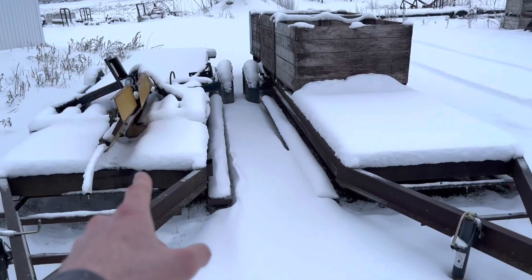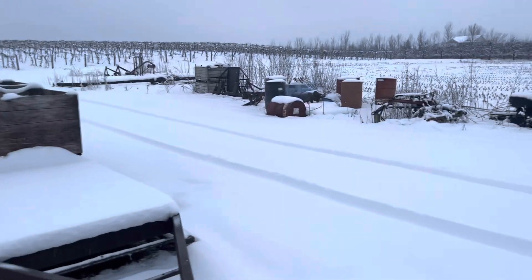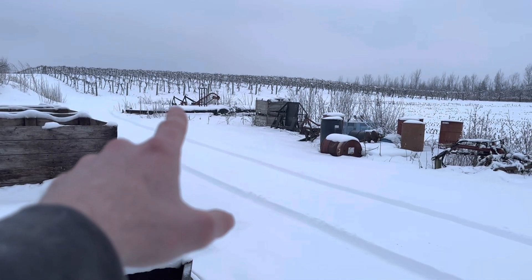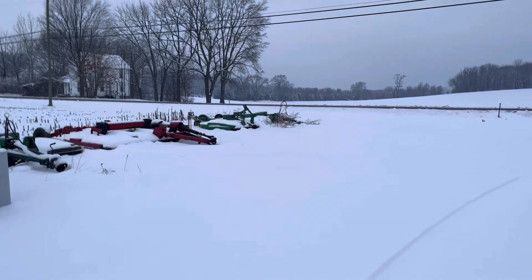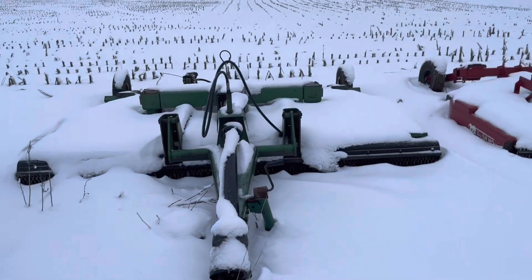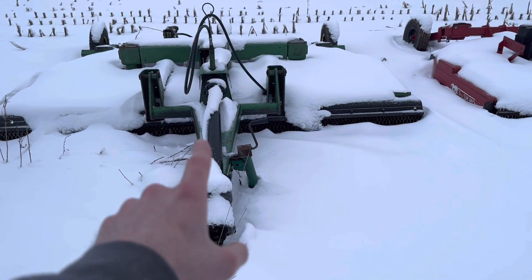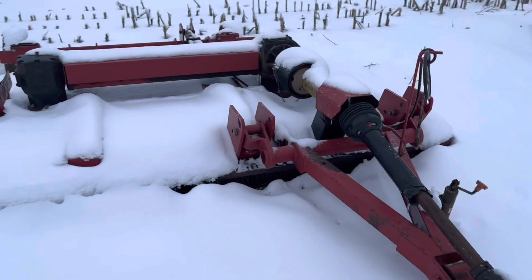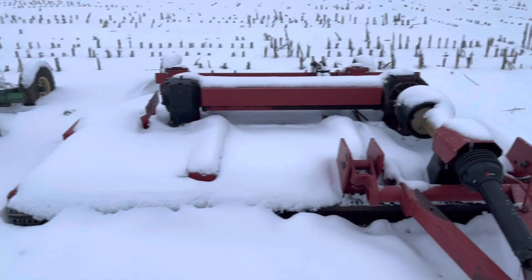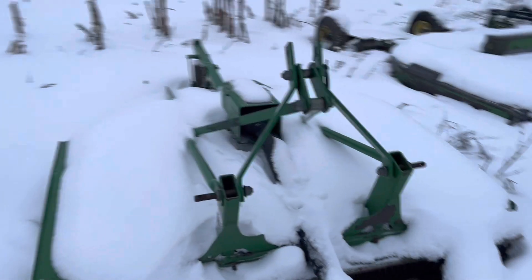We have our Phil Brown weed spray boom — this is the single; we have a double that's off-site right now being made. Back here we have two five-foot rotary choppers that we use in grapes, and an MX6 rotary chopper also used in grapes. The six-foot is probably my favorite but for tighter spacings those five-footers work great. We have an MX8 being built right now that'll be here soon for our high-density orchards.